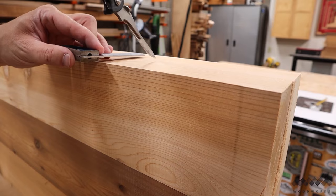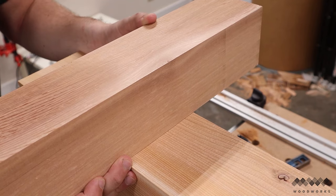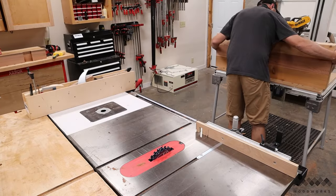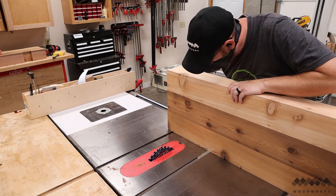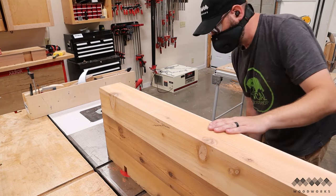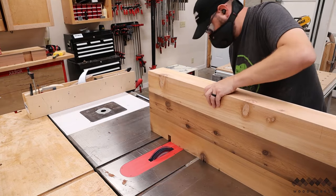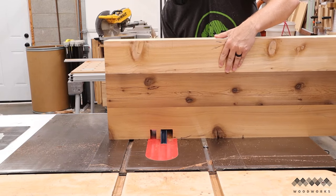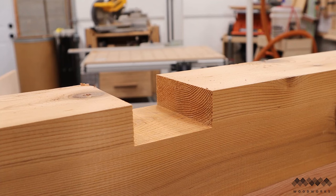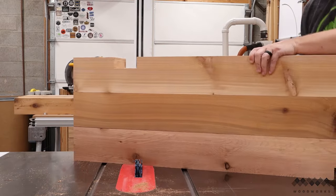The next step is cutting the joinery in the legs. I begin by laying out where the notches will be cut in the benchtop using a marking knife. To get a tight fit, I use one of my legs as a guide to lay out the other side of the notch. Now to hog out these notches, I'm using my table saw with a dado stack. Before I began this process, I waxed down the surface of the saw to make sure everything was nice and slidey. The safest approach is to make one pass, then turn off the saw before moving the workpiece back to the other side of the blade and making the next cut. Just like that, I have a clean notch and it's a good fit with the leg, and I repeated that process to create the four notches in the sides of the bench.